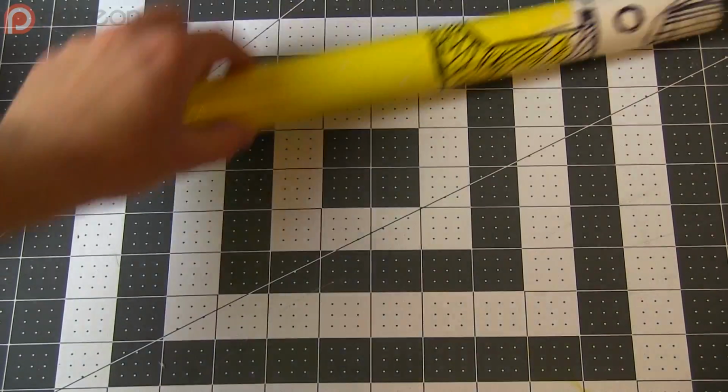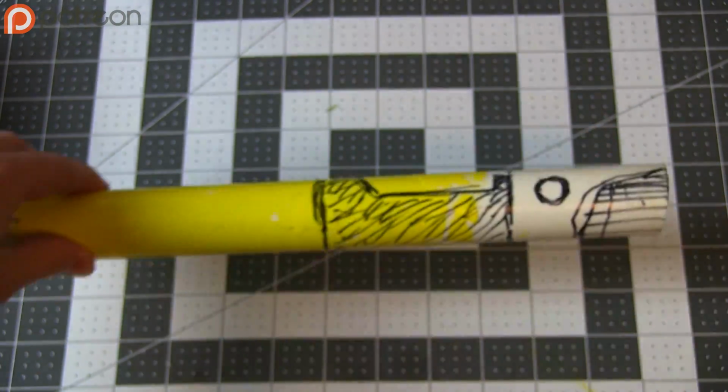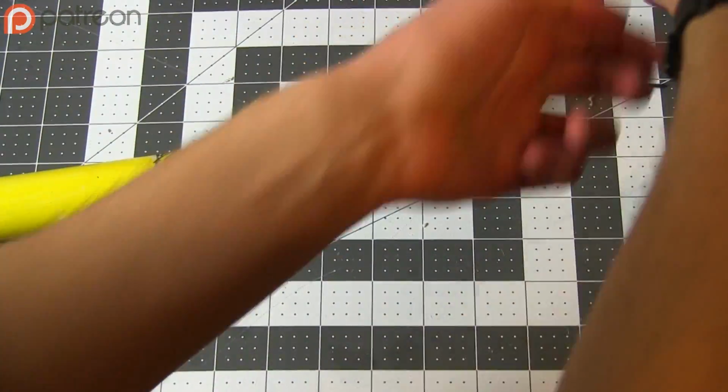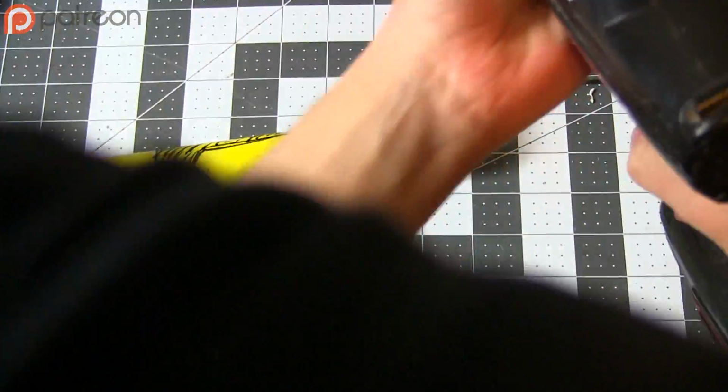First I drew the shape of the outermost casing on a piece of scrap PVC pipe, shading the areas that I don't want to keep. Then I drilled holes in the side, starting with a small drill bit for the pilot hole so that the large drill bit wouldn't walk on me. I did this before cutting out the shapes that I drew so as not to compromise the structural integrity of the pipe.